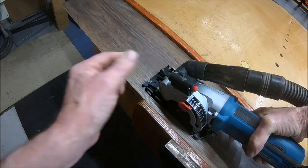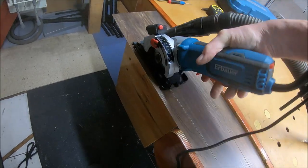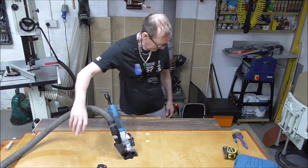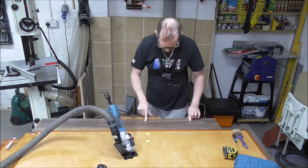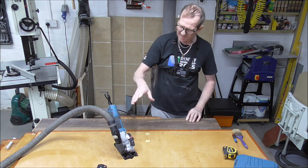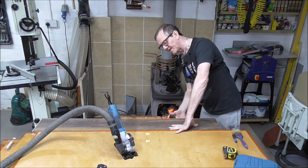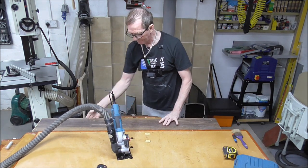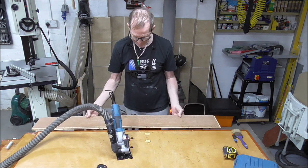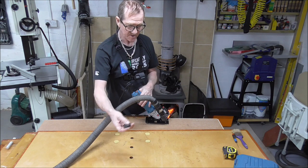The cut is simple, the cut is straight, the cut is clean. On this side, of course, you're going to get chip outs, because you always do with the blade on the top surface. The dust extraction on the surface was lovely, but it wasn't powerful enough to stop it going underneath. What I'll do now is turn it over and see what we get on cleanliness of cut. But the main thing on this is to see how clean the line will cut on the reverse side.